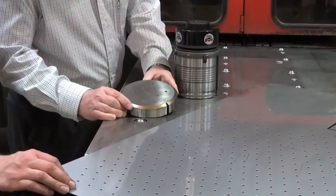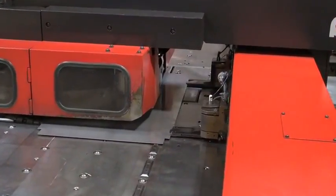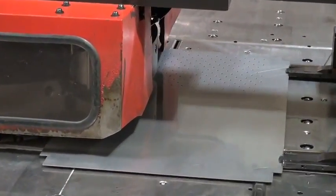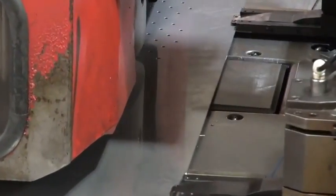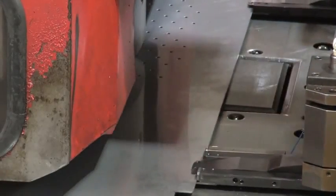Gary Troxel's recommendation was to replace it with a mate 9-hole cluster tool. Punching nine holes with one press hit really speeds up the process. And with mate, punching sheets stay flat, there's no distortion, hole edges are smooth, no rough edges or burrs, so there's no secondary operations needed.